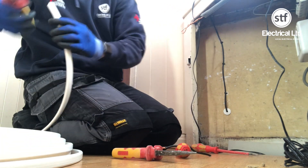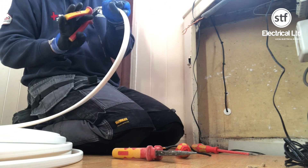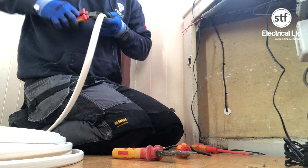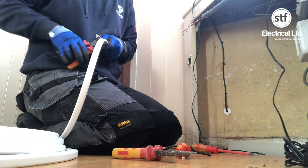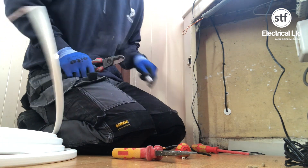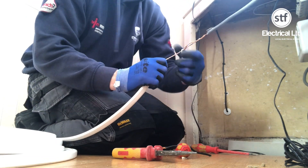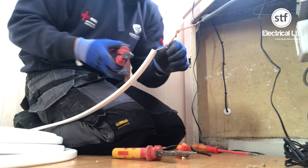What you're looking at now is me stripping back the old existing 6mm cable, which helpfully went up a cavity into the first floor, preventing a little bit of trunking on the ground level. I'm stripping back the new 10mm LSF twin and earth that's going to thread through the eye I've just made on the existing CPC and come back around on itself to make a nice secure fish to get up that wall. Once done, the more you try to pull the two cables apart, the more it tightens — so we very rarely lose a cable in the wall when pulling in this manner.